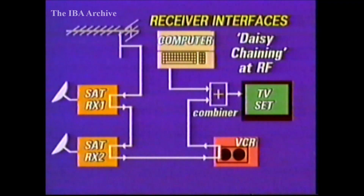This also has the advantage of being able to feed everything to additional TV sets around the house. But depending on where you live and which channels contain broadcast transmissions, this daisy chaining at RF can be fraught. Either there's patterning on the satellite or VCR playback channels, or these units can interfere with reception of the normal off-air terrestrial programs. A greater range of adjustment on built-in modulators would help considerably, but there are more problems.